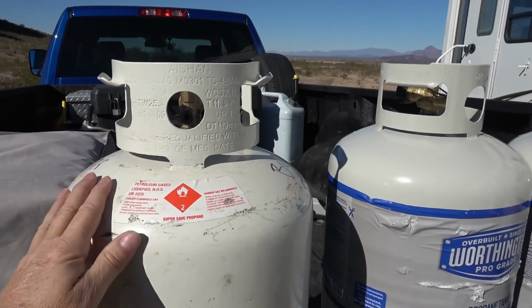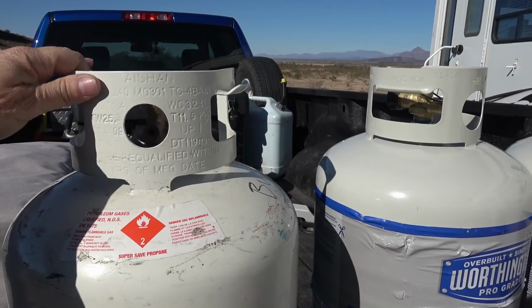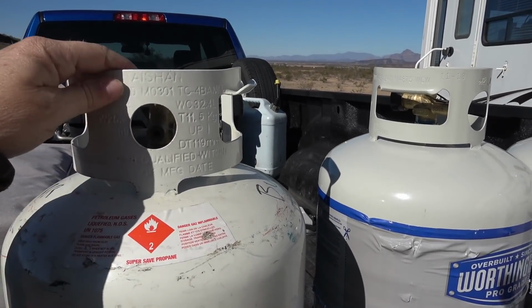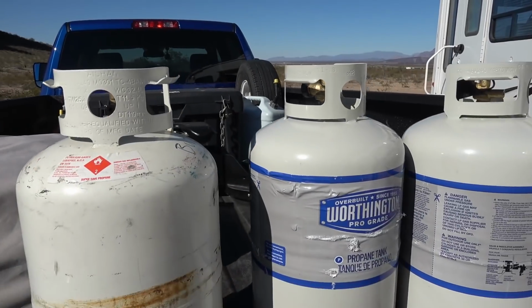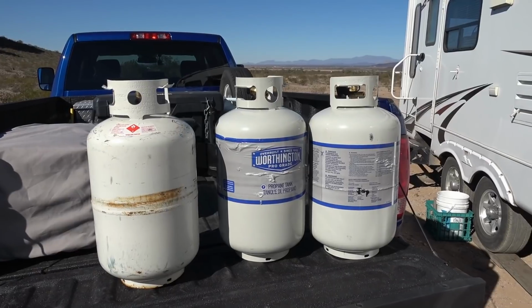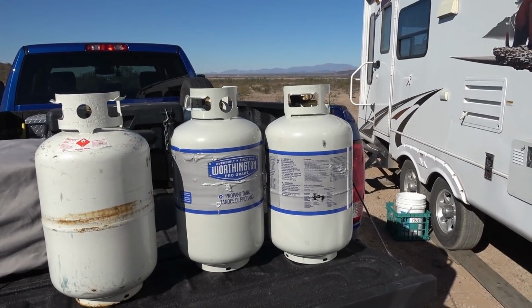The other thing about the recertification, a lot of times I've read it's only good for 5 years, and then you have to go get it redone again. I think you can get it done 3 times. Like I say, it varies from state to state and province to province, so you'd have to check on that, but I decided to go with new tanks.